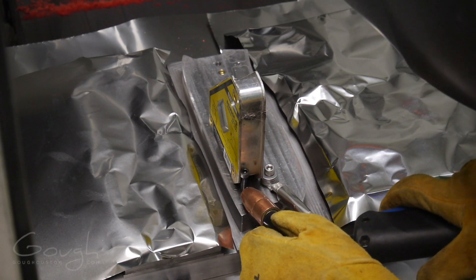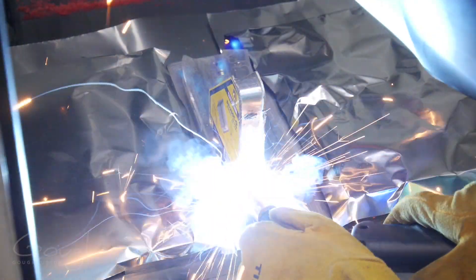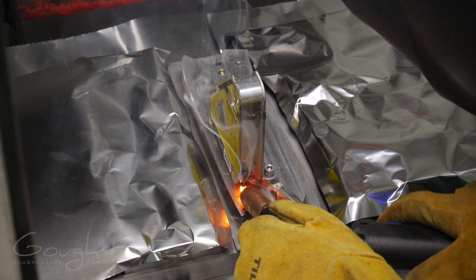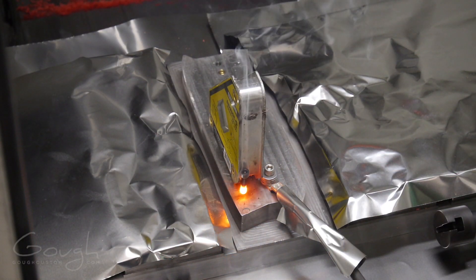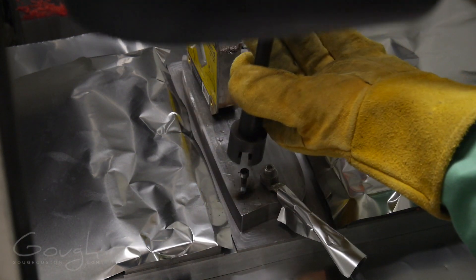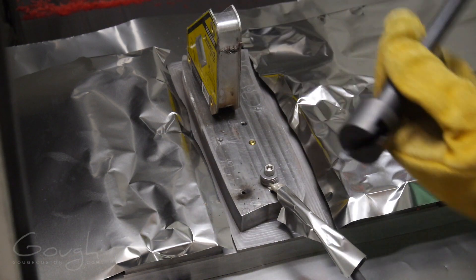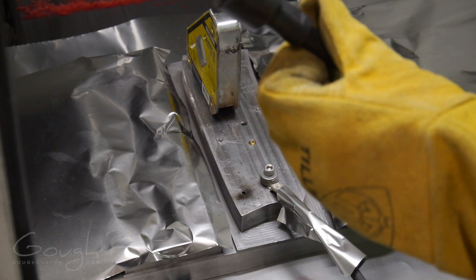Next I tried a couple of quick ways of removing the dowel pins — I was really hoping to just get them out with vice grips or something, but it seems I did too good a job of putting them in. With the easy options not working, it's time to bring out the big guns, and that requires some welding. What I'm doing now is tack-welding the ends of some socket head cap screws to the top of each dowel pin. This lets me use the cap screw as a handle for a slide hammer, which produces a ton of force to yank the dowel pins right out of the fixture. And that worked beautifully.